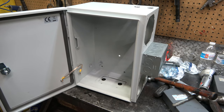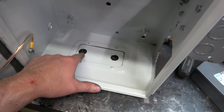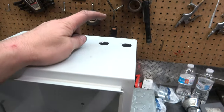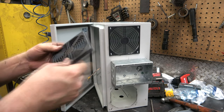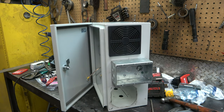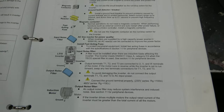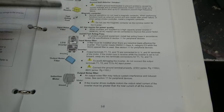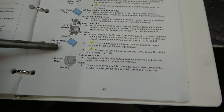If there are any electricians out there watching this, why don't you tell me how many NEC rules I'm violating here. I'm going to have my 240 coming in here, my 120 coming in here, this will be for my e-stop, this will be to the motor, and this will be to the control. I got this vent deal screwed on. Fast-acting fuses — I went online and got these 20-amp fuses. I picked 20 because of the chart showing input current of 15.5 amps, but I just realized the back of the book recommends a 30. I'm going to try what I've got. The lower the fuse the better if it works. Then the fuse block, and I got an input noise filter.